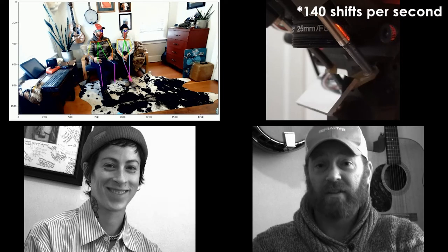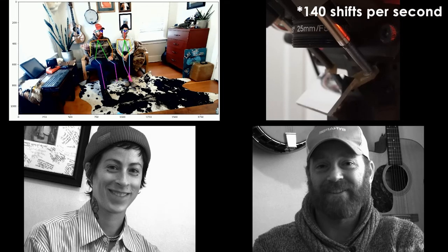With all of this combined, we can track the locations of multiple individuals as they pass in front of that optical camera. We use the pose estimation information to determine where we want to position those brushless DC motors in order to point that mirror at different locations. We can do that multiple times a second and position the mirror to monitor all the individuals within the frame.